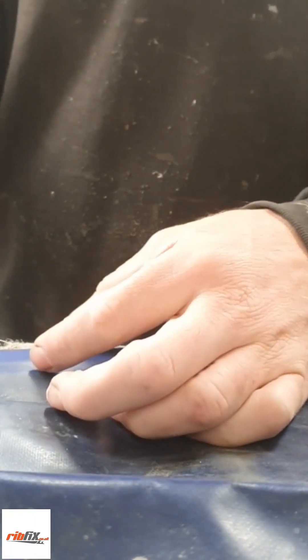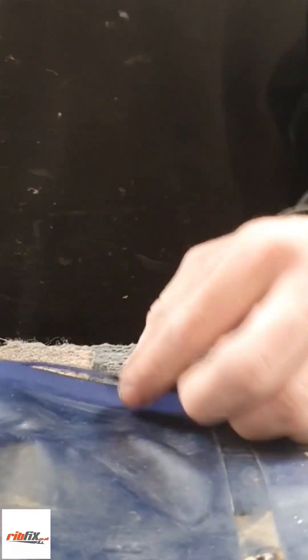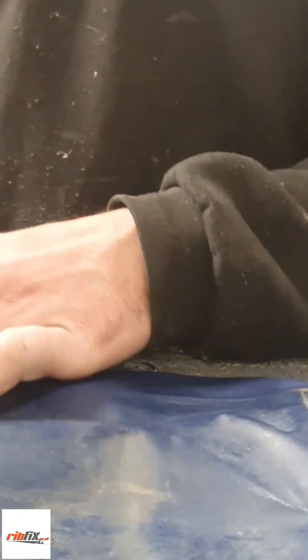I can still see a line on there, but if you were going to be doing it from fresh, you'd mark an inch or 30 mil along one side, and flip it and you'd mark 30 mil along here, and then you'd sand that. Sand that like I already have, wipe it down now.